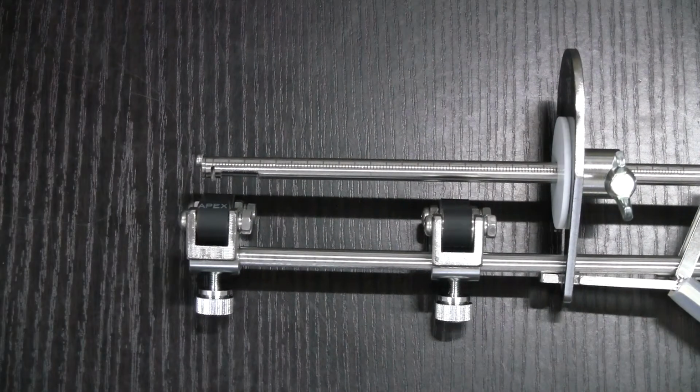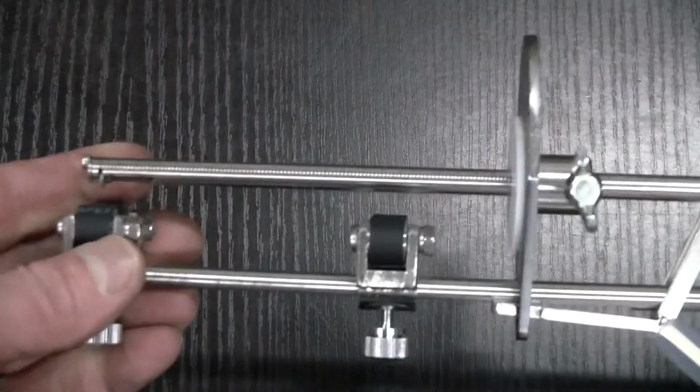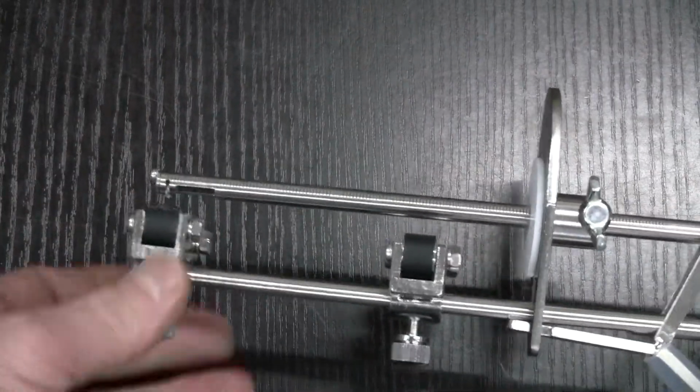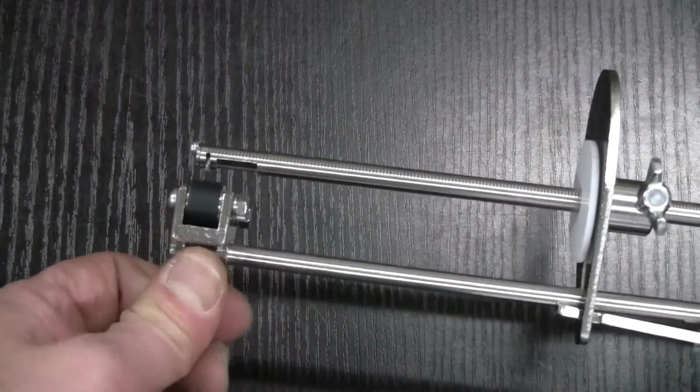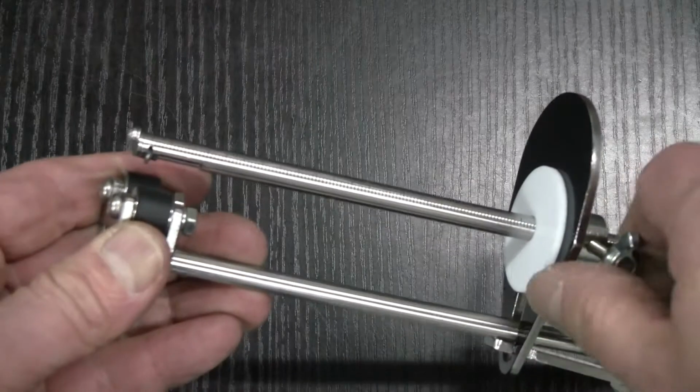Glass tube hand cutter. How to use one. 1. Your hand cutter comes with a cutting wheel pre-installed and is ready to use. Do not apply oil or lubricant. It works best grease-free and dry.